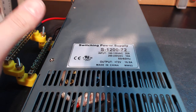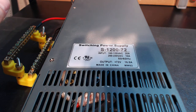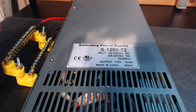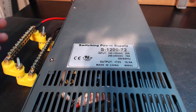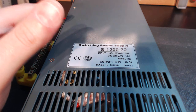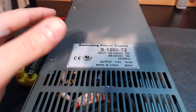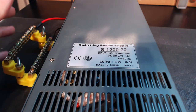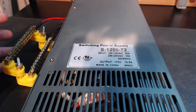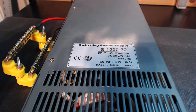Gecko rates it at 80 volts — you probably could go even slightly above that, but I don't recommend it and Gecko certainly doesn't recommend it. I wanted something simple. Anybody dealing with a smaller system, like a G540 system, you're not usually dealing with that many hookups. It's a much smaller driver package, integrated wise — you're not dealing with lots of breakout boards and all that.